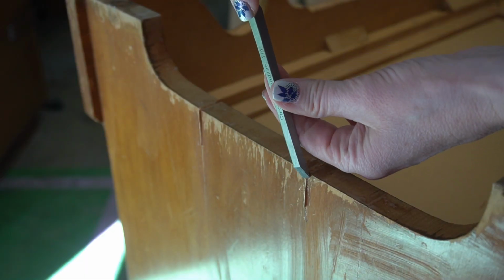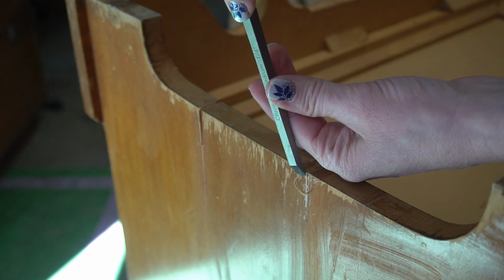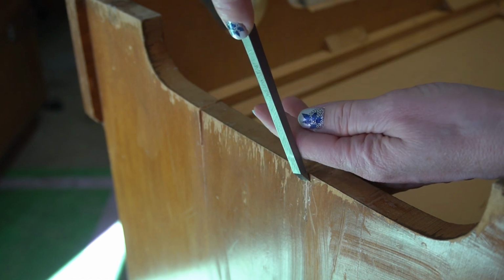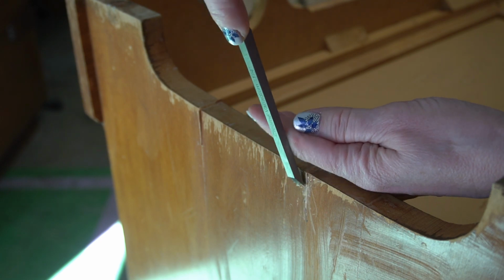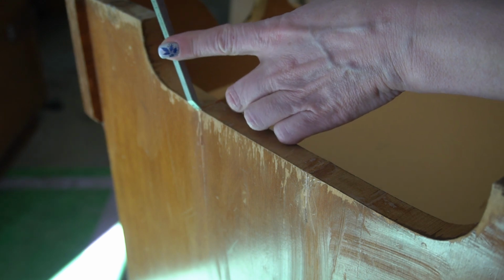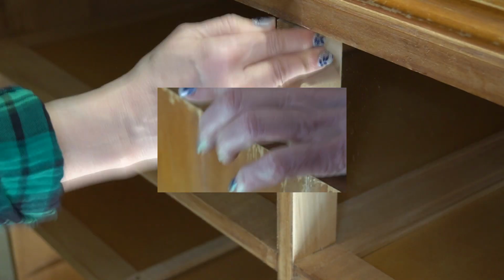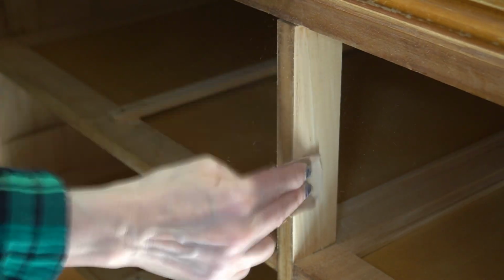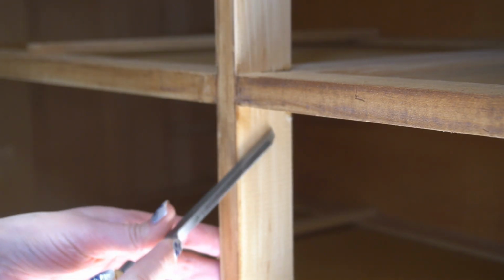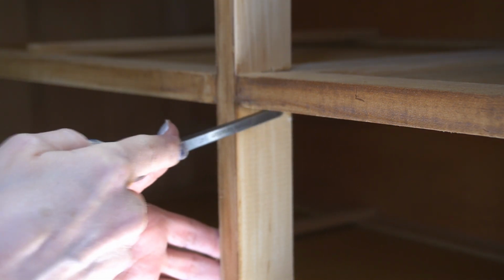One of the other repairs I mentioned was adding splines to the splits in some of the wood. That worked like a charm, and I'm sorry I didn't get it on camera. But as you can see, I left the edges slightly proud of the surface on all faces. That way, I could chisel down the excess wood and glue before sanding everything to flat. I sanded down some overspray from the original factory finish, and I chiseled off some small spots where glue had seeped out during assembly. It wasn't impacting the drawers or anything, but I feel like it looks more professional with that removed.